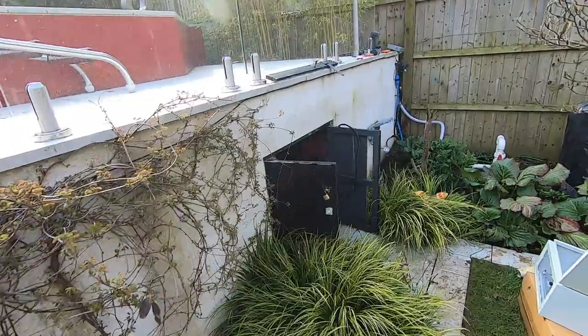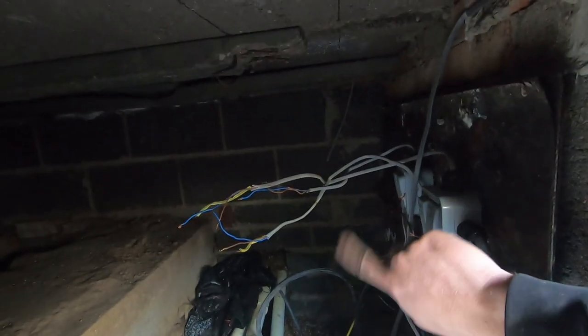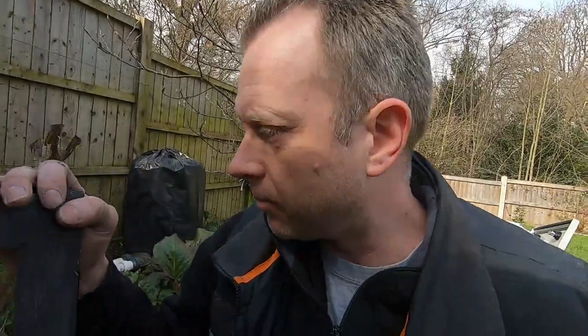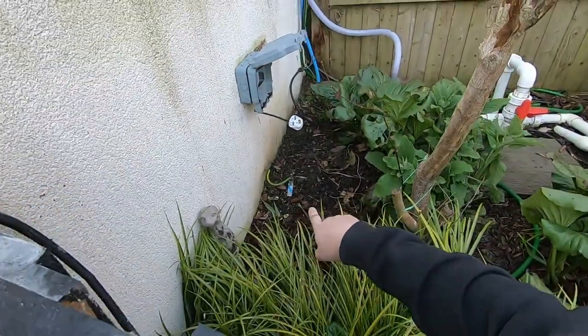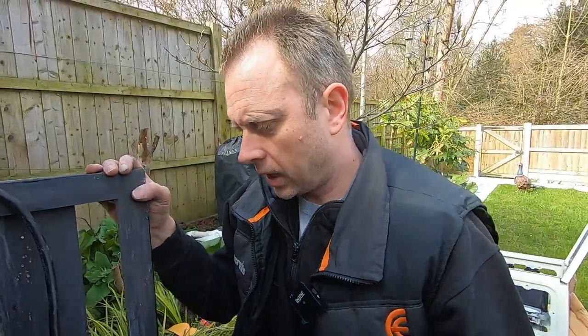You've got two accesses to the pump house. There's a fuse board on the wall — I've stripped it all out. It's a bit dark but there are loads of armoured cables, and as normal, nobody has earthed the sheath of the armoured. They've also brought the earth out from the house. I need to see what system type it is — whether it's TN-CS or TNS — but judging by the age I reckon it's TN-CS. They've brought the earth from the house into the fuse board and also put an earth rod in and connected that as well, which sort of defeats the object of putting a rod in.